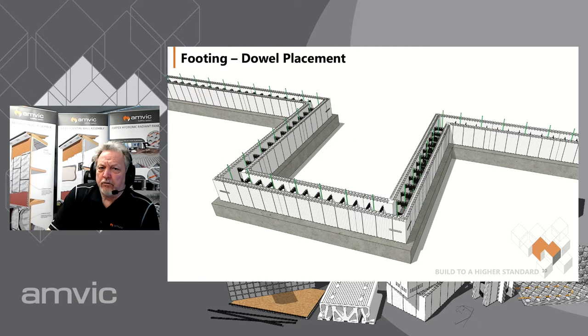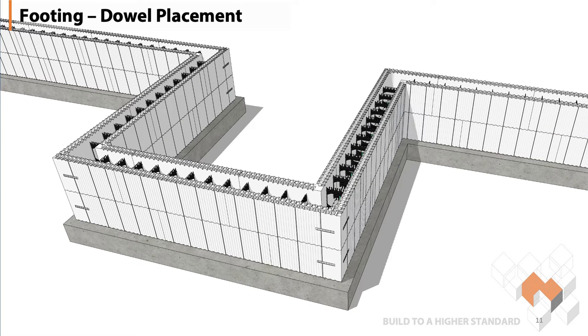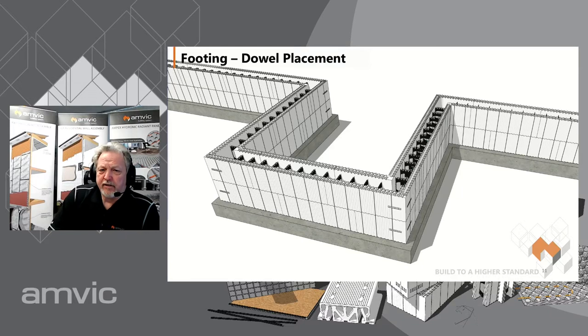There's what looks like a complete roll around. Rebars are still sticking up because in most cases they're approximately 24 inches above the footing. That allows you to get a really good splice overlap with the vertical rebars that you're going to put in the top of the wall when you get to the top before you pour. The second row continues on the same way, and once you get to the top of this wall you'll be setting your verticals in there. It'll create the rebar lap splice required to connect your wall to your footing properly.